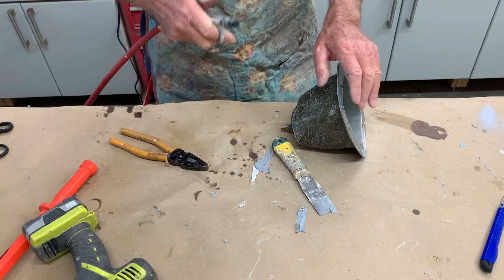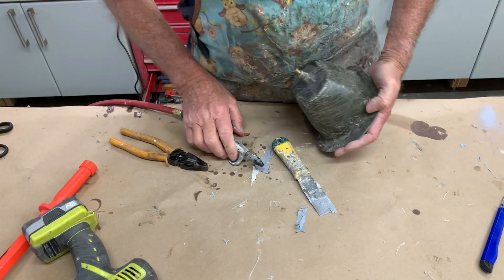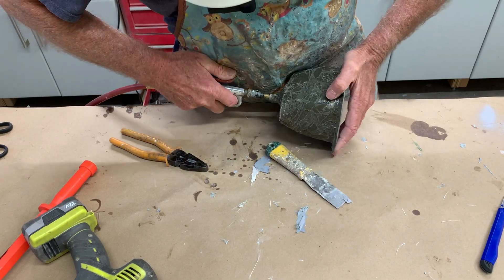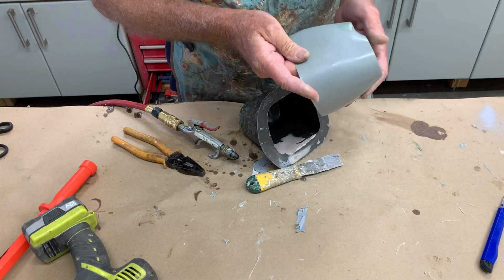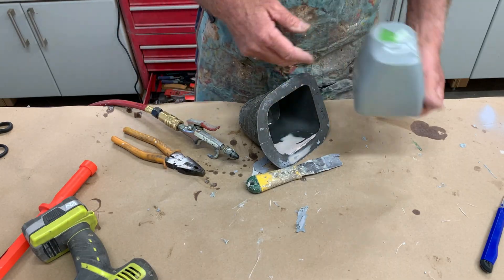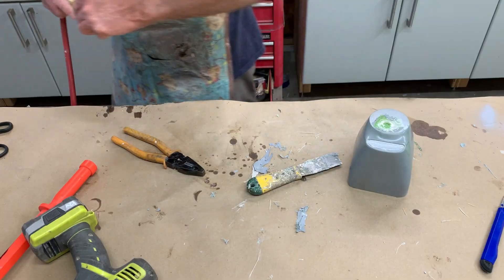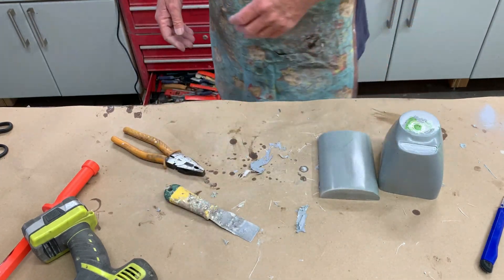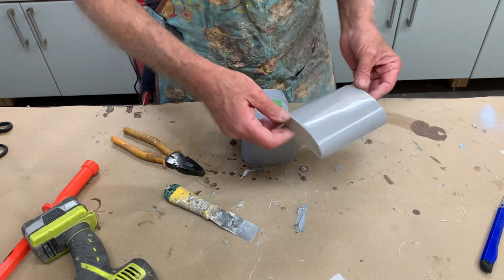Time to pop out the cowl. Sometimes they pop right out like a bullet, sometimes they just gently pop out, so let's see what we can do with this. I'm set to 80 PSI — try and push onto it. This is getting a little hard; I really need to get a new one. There we go, gently. Everything is looking pretty good — just a bunch of PVA on it as you can see the green stuff. Now she just needs to be cleaned off and washed down with hot water and soap.